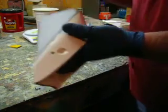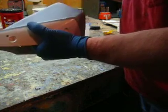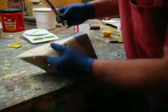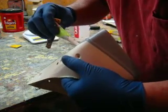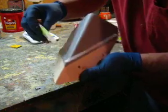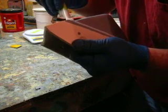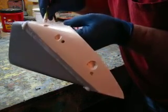Now I'm going to take my piece. I waxed this several times and then put my part all on there. Once that's set up, I put my primer on. Now I've got to put this thickened epoxy in these corners because glass just doesn't like to be in corners — we all know that. So we just want to get a nice bead right there in those corners like that.